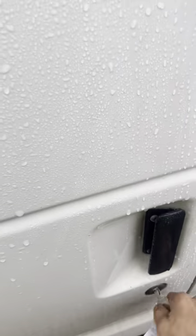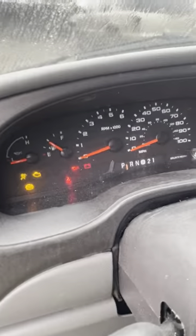The next thing you want to do when picking up a box truck — you can pick it up from the front, but you got to do under 40, 50. Next thing you want to do is put the truck in neutral.